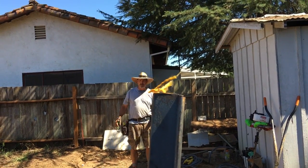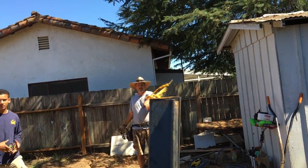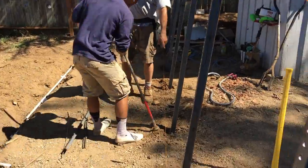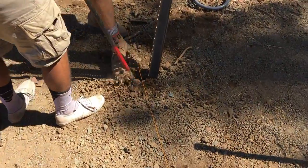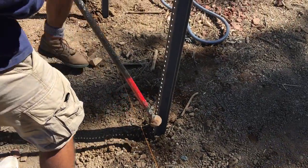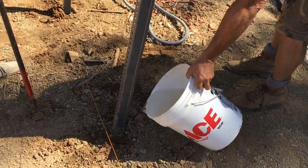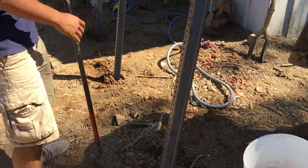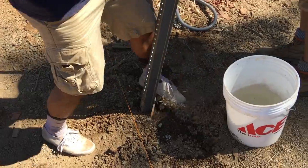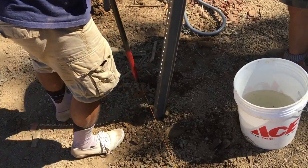Since the bottom is straight and we pack them — Jeff, pack this one right here. Jeff loves being on TV. He's packing this hole like that. Then we go like this, put a little more dirt in, packet. We got the angle right. Then he fills it up with a little water and then packs it again. You put some more dirt on it so you don't splash the dirt everywhere. And now he's going to tamp it down with the tamper — all around.